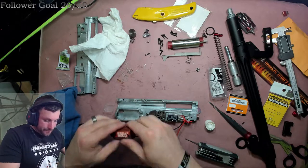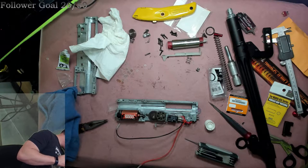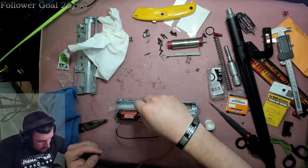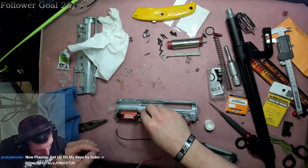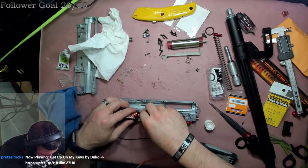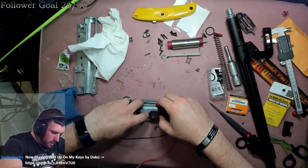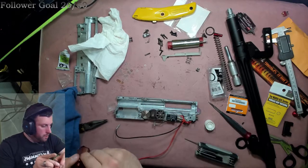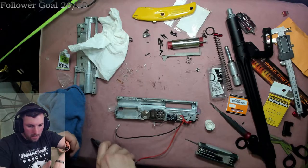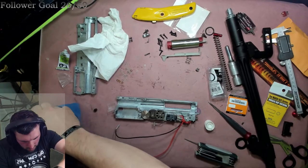All right, so that's there. So that might be the right length, even though I cut the shaft a touch short. Hey buddy. So next thing we're gonna do is set down the bevel gear, see what it looks like. All right, so I actually need to shorten this a bit. Crazy. So the distance from the shoulder to the shaft might be shorter in this one than the one that I started with. All right, so the glue wasn't completely dry, so it was pretty easy to take it off.